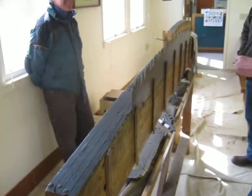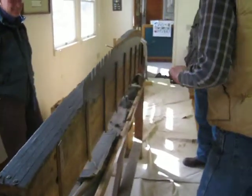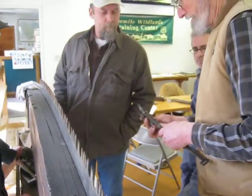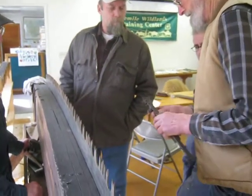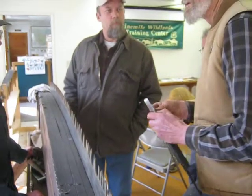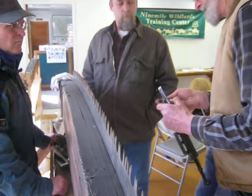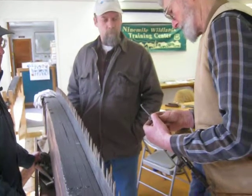I need to put my joiners back together. One thing when you're using these joiners, or any of the tools, you've got them up on the saw — don't leave them unattended on the saw. Don't have them up on the saw and then take your hands off of them. Because if they fall off, the least that might happen is knock the tool out of adjustment.